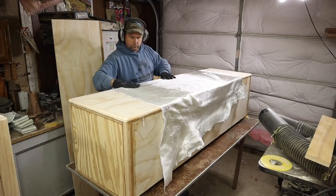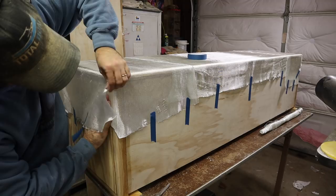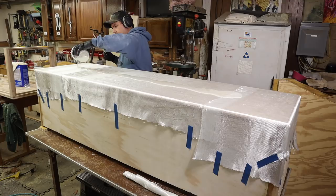Now you can see why we took the time to round over the exterior pieces of the frame and the bottom panel on each tank, and that's so we could come back and install some fiberglass cloth and epoxy. Obviously, these tanks will be in the bilge and exposed to moisture and water, and we want to make them as resilient as possible. This process also adds a lot of strength and waterproofing to each tank, so it's a good choice to do either way.